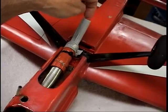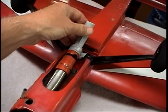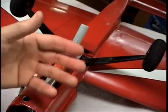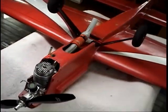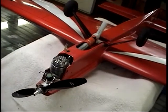And know what, this is a critical number. This exhaust restriction is your final, it's called a belly bleeder, whether it's a pipe or a muffler. You need to know that has to be accurate, or if it's too small, the engine doesn't run right and overheats. Too open, the motor will just tend to run away in windy situations. So all things in stunt are always a balance and a compromise.